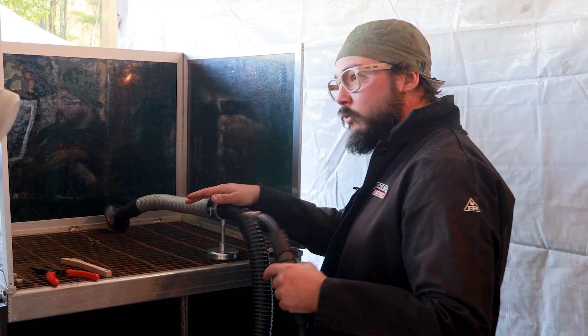Campers were given a safety briefing, then an overview of the equipment they would be using for the day. Once they had all their PPE on and understood the equipment, they could pick from a few different project options. Before they could weld those pieces though, they had to knock off the dross, because welding over dross can lead to contamination in your weld, like porosity.